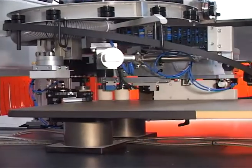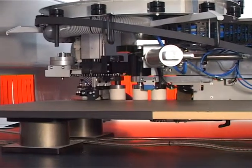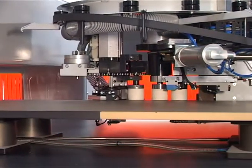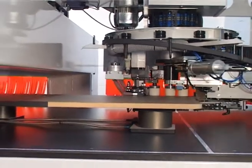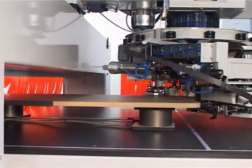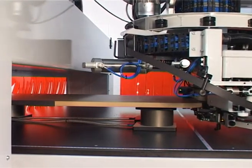The clever suspension of this unit enables it to follow complex shapes, including keyboard cutouts, with ease. Top and bottom tracer shoes and a horizontal shoe control the radius cutter heads as they travel around the panel in the same path as the edge application cycle. This dramatically reduces processing times.